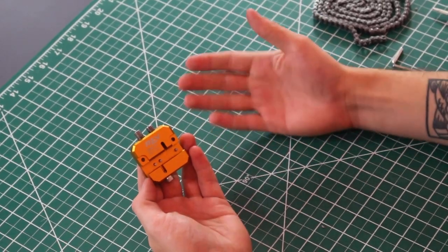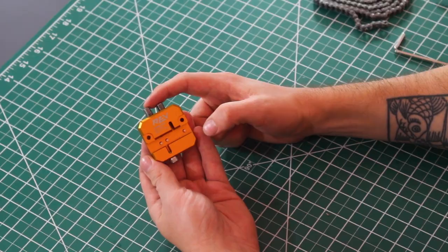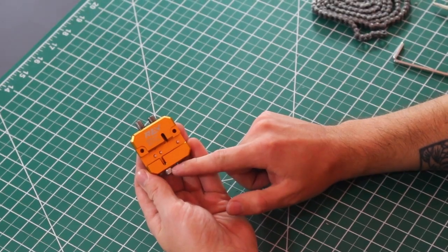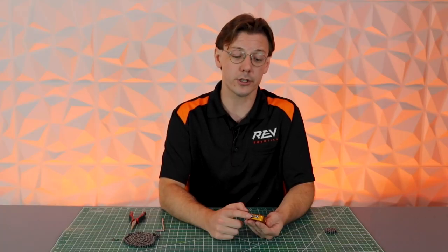Before we get started we should talk about the anatomy of the number 25 chain break tool. What we have is a pin screw — the pin screw itself ends up pushing the pin through the chain, breaking the chain. Below that we have the cup point screw, which when placed in will help prevent the pin from being pushed all the way out. If your team is using master links you're going to want to remove the cup point screw when you are breaking chain. The last portion is the compression screw, which serves two functions: to hold the chain in place in the guide so you don't bend the pin screw, and if you leave the pin in place in the chain, you're able to press it back through with no need for a master link.